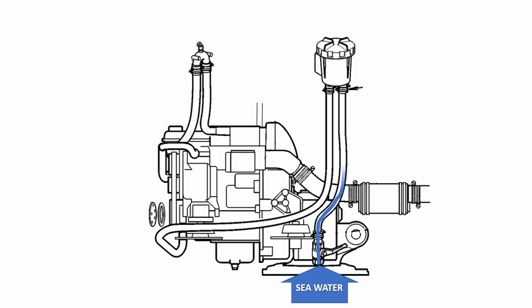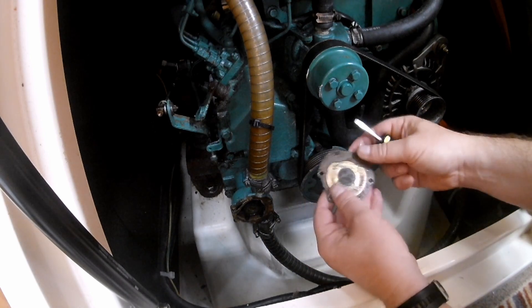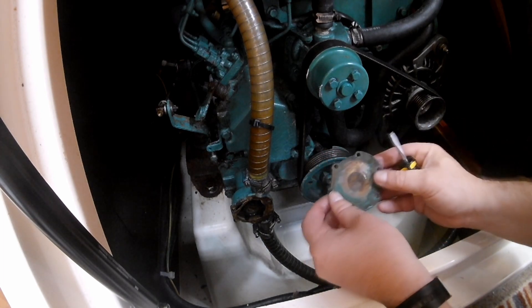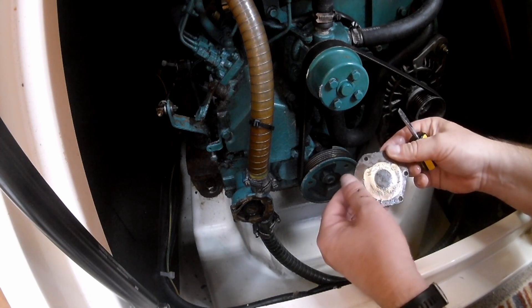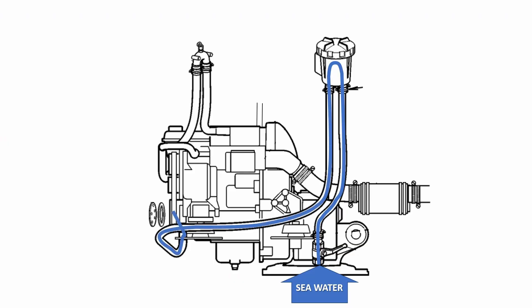A loss of suction can only really be in two places: the strainer has a crack, or the lid isn't sealing properly. I checked and there's no sign of any problem with the strainer. The other possibility is that the pump isn't sealing correctly, meaning it doesn't have enough suction to draw water up into the strainer when the system is empty. When your raw water pump starts to wear out, it's possible with some types of pump to reverse the cover and effectively provide an unworn face for the pump housing. Reading the cover it says 'loosen cover to drain' — and it appears the previous owner has already put it on the wrong way around, so the reverse side of the pump cover has worn out as well. Once the system is primed full of water, the pump only has to keep a siphon going rather than draw water up through the strainer from dry. So if we manually prime the raw water system we should be able to get the boat back to the nearest marina and effect a proper repair.